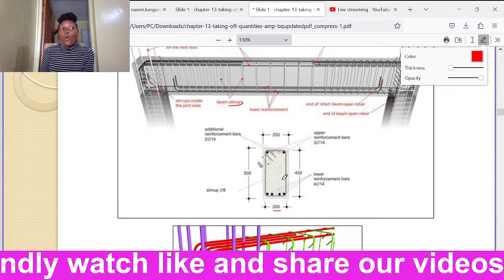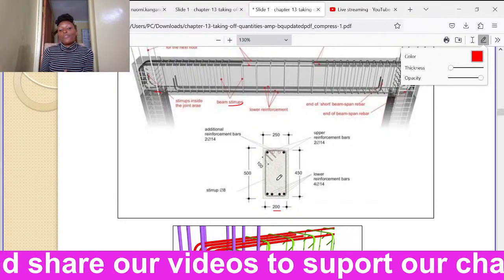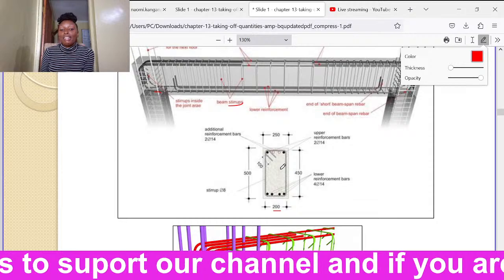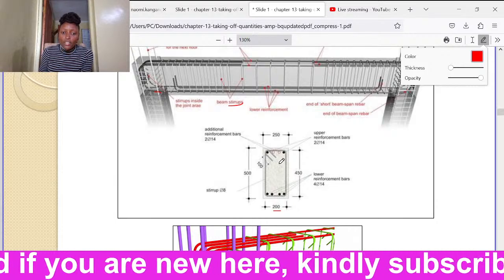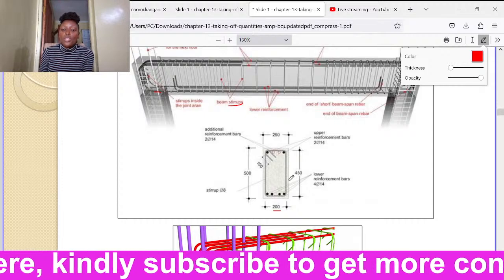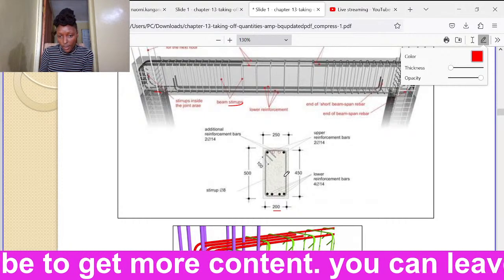That's why when you walk inside a building, a high-rise building, maybe going to the first floor, you'll never see a reinforcement bar. It doesn't mean that the building doesn't have reinforcement, it's just that they usually have a cover. So every time that we are calculating for reinforcement, we should remember to always leave some space between the size of the beam that we want and where the reinforcement should be, all right?